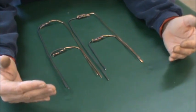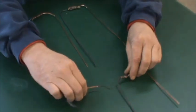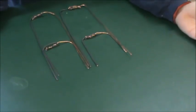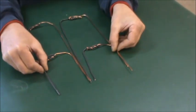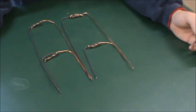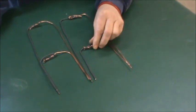This is four cells total — we've got four separate wires here. Lay them in, twist them all together, and you would have a 2S2P pack, or cell module. That's exactly what it looks like inside the modules on our battery pack — that's how it's wired together. I hope that clears up some questions. If you have any more questions, let me know and I'll try to make a video to answer. I know this is crude, but at least it gives you a visual, and I think the visual is what helps.